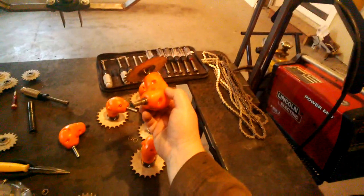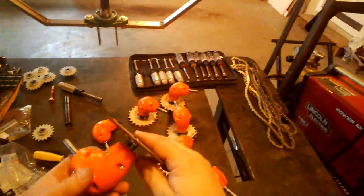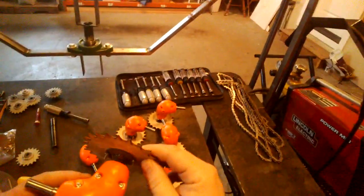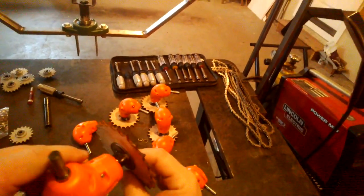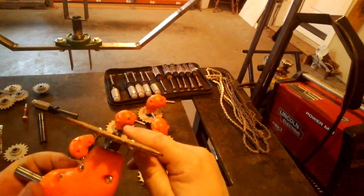Okay, so we've removed all of the right angle drives with the sprockets from the prototype here. It's now spinning free. So now we need to just remove all these. Of course, these have all been Loctited in place, but only with the lower strength Loctite. Eventually, I will probably just end up welding them in place. But of course, I want to be sure, really sure I like what I have by then. I'm glad I didn't with the wood sprockets, for instance. So let's get these off.